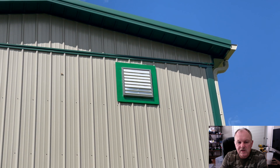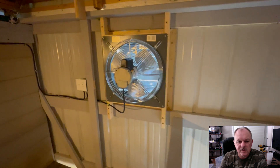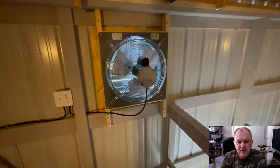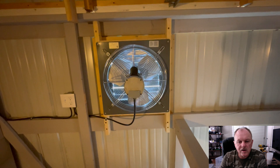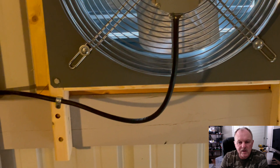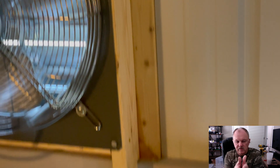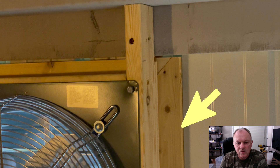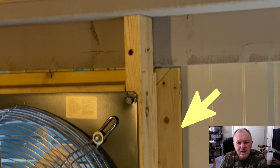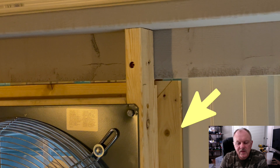Let's also take a look at the inside of the installation. Included in my kit from Haslett was an interior frame package — really just four pieces of wood and some screws, sized to match the opening of your frame on the exterior. That way you can sandwich the siding in between the interior frame and the exterior frame and screw those together.